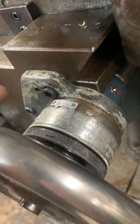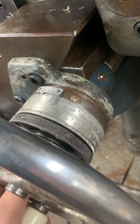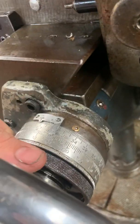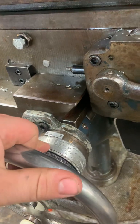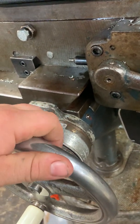This one I stripped and cleaned the other day — it was filthy. It works conventionally with a lock ring that tightens, but tightening that ring wasn't actually producing a consistent result; you're still losing your zero. Every now and again you'd only be a few thou off, and then you'd go a few thou the other way.